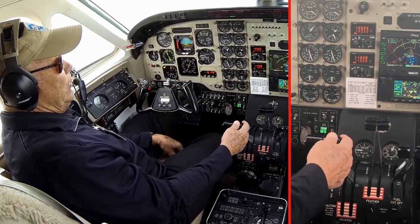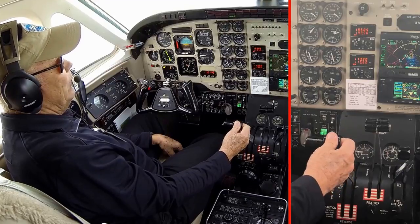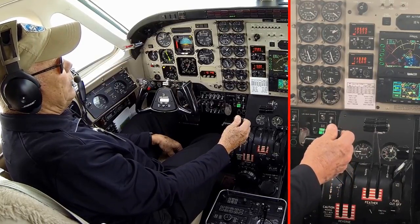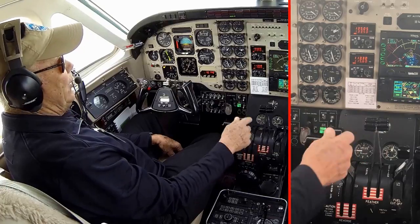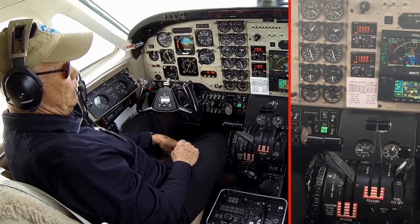And let's check this the other way too. Going forward to see how much the dead band exists in front of idle. Not very much, we hope. There it is, picking up just like the other side. About half an inch down here, an inch up at the knob position before it picks up.